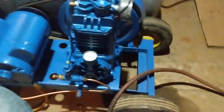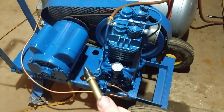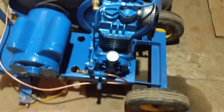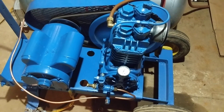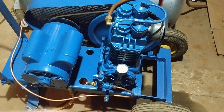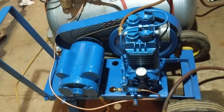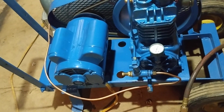Because there's no pressure on the cylinders, the point of this is continuous run. When you let out pressure, the compressor kicks back on to keep the unit fed. It goes back up to pressure and unloads again - the compressor freewheels. The rule of thumb I've come across, and heard from a few different people, is that Quincy recommends - I think primarily for motor longevity, to keep the starter capacitor healthy - that if your compressor kicks on or off more than five to seven times in an hour, you need to let it run continuously.